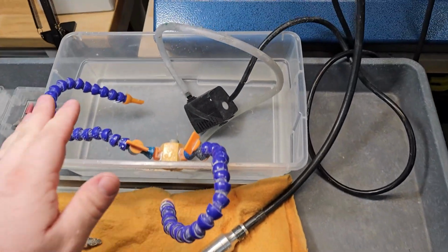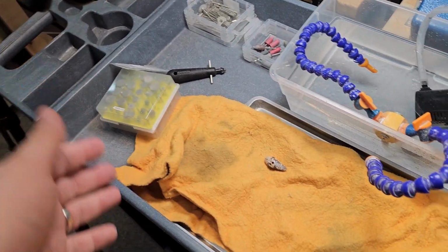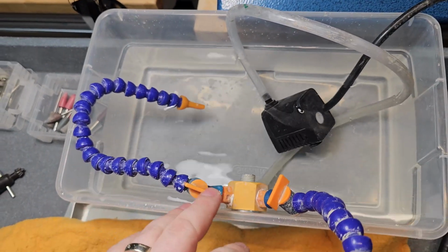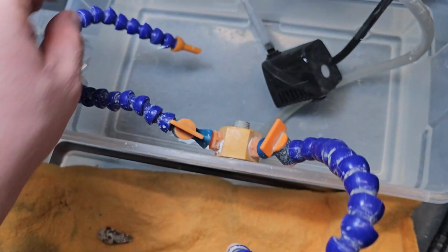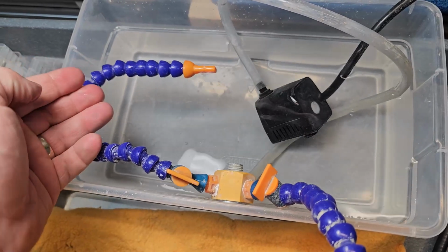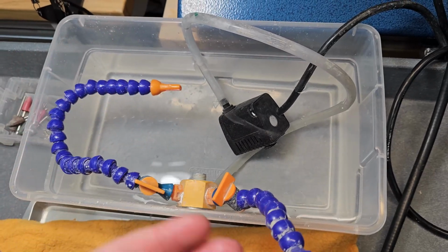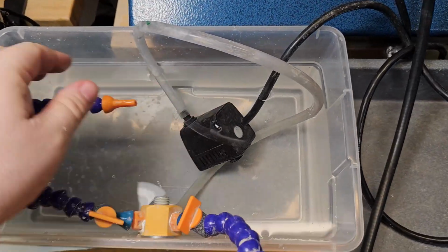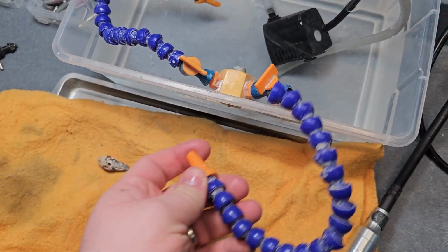And then as far as what I'm using to cool what I'm doing, because we don't want to create dust, and we want to keep the bits lubricated with water, I use a water pump. I have just a container of water here, and of course I have a ShamWow to help absorb the water, so I can just dump it elsewhere. Of course it's not turned on right now, but one of the pumps is actually relieving the pressure of water back into the tray, so the pump is not being overworked. I don't know how to describe it, but basically it relieves the pressure from the pump. So this one's open full blast, and then I open this one just a little bit to allow a little water in. Of course, I'll fix that here in a second.